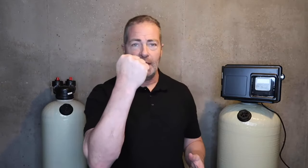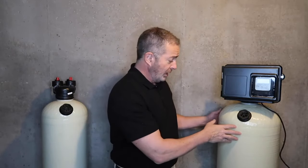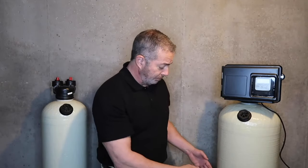Like I said, the basket is about the size of a human fist, and it also cuts down on the flow. With this size unit — a 2.5 cubic foot system — customers don't even notice any pressure drop for the most part, and that's extremely important on a well.